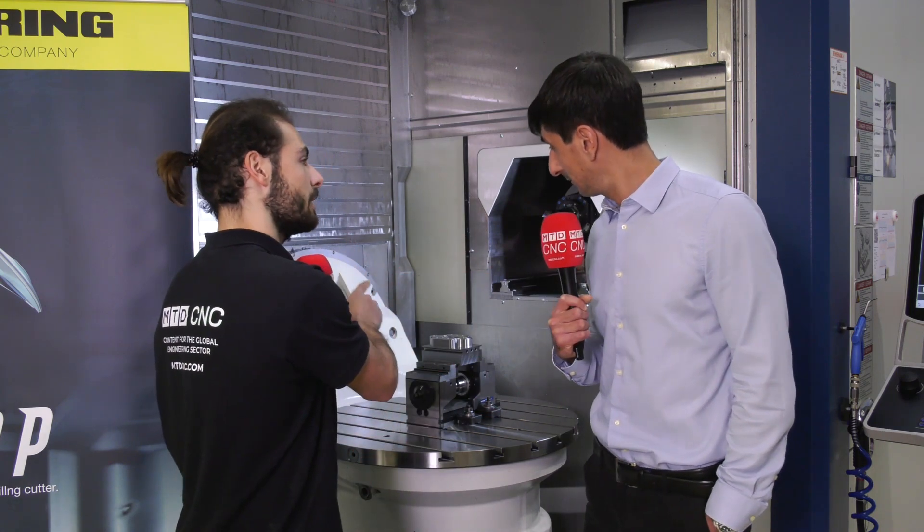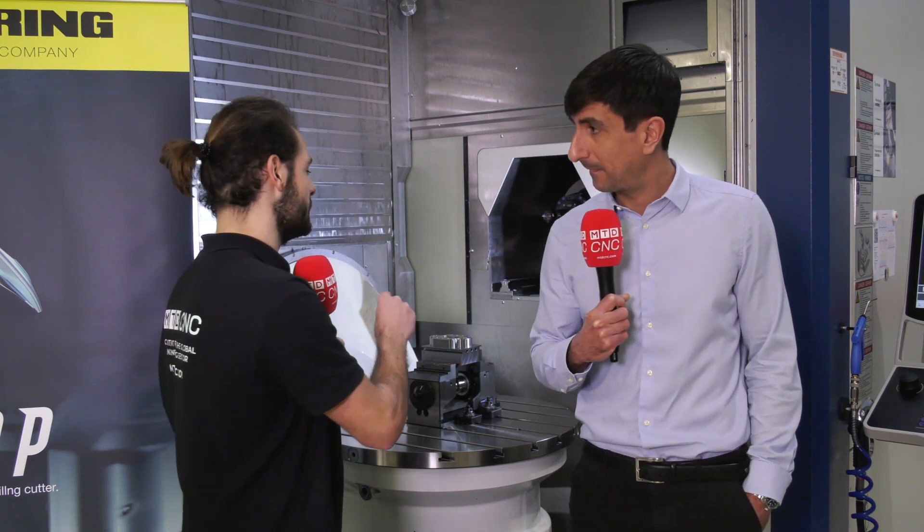You're doing this before some reaming operations. Would you normally use this drill before a reaming operation because it's got high tolerance? It's just a go-to higher performance drill for steels. You can run a lot quicker with this drill compared to our traditional universal drill, which we would have used before on steels. If you want to reduce cycle times on any steel material, pick the XF.